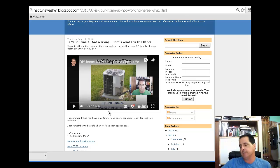Usually you flip it up and you can have a circuit breaker in there, or mine's got a pull-out thing. It's a pull-out jumper bar, and it's plastic, and it's got bus bars behind it, so it actually makes the connections. But some of them have breakers. You can turn off the breaker. You want to take away the power, because you'll be opening up the unit.